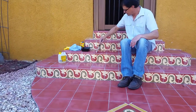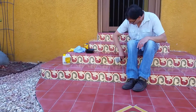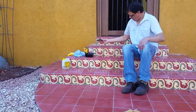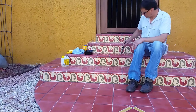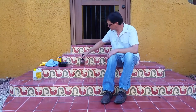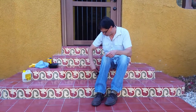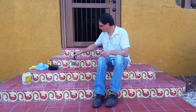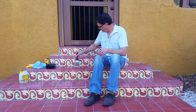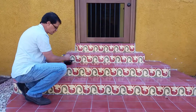As you can see already, it does darken the cement tile. If you see it pooling or building up, use some rags to rub it down to keep that from happening. Remember, this tile has already been sealed once before, so you're not seeing the cement tile soak up the sealer like you would with a brand new piece. That's why you want to be careful with the quantity you apply — you don't want any pools or bubbles. Just make sure it gets nicely and cleanly applied.